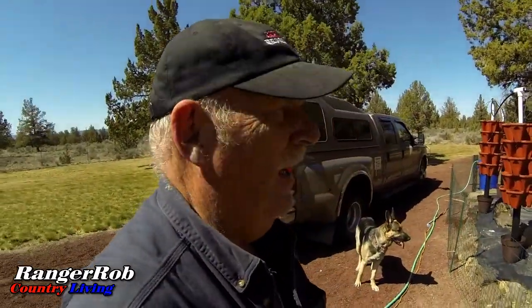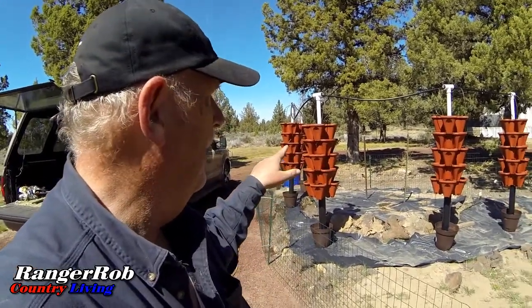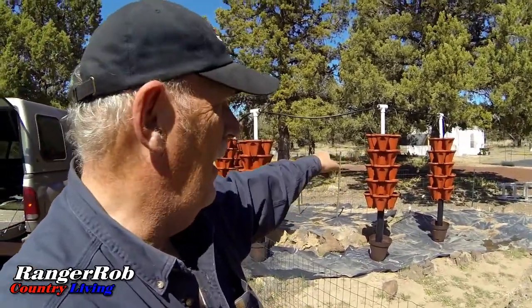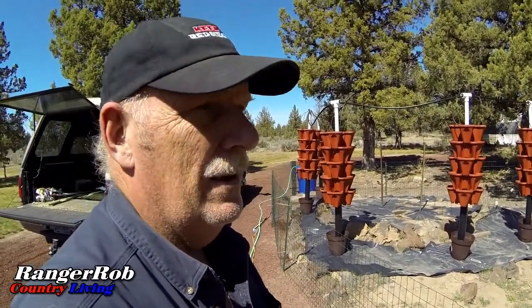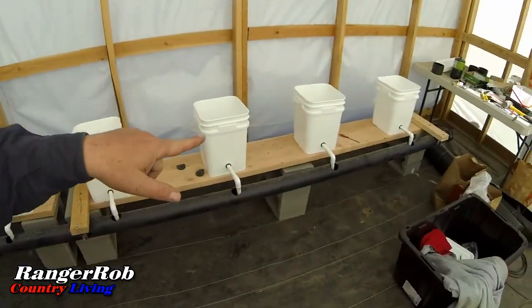Well guys, I have to say there's a fail as far as having a big enough pump — I went too light. So I'm going to get on Amazon and order what I want. I want to be at least 400 to 500 gallons per hour. Just not enough power to get enough water to these last two towers. Hey, live and learn. To finish up my day — I did order my pumps. I'm going with an 800-gallon-an-hour pump and I ordered two of them, so I'm going to need it for this system too. But today I got my compressor and we're going to blow these lines out and clean them out after drilling. It'll probably be noisy so I won't be able to talk — let's see how well this works.